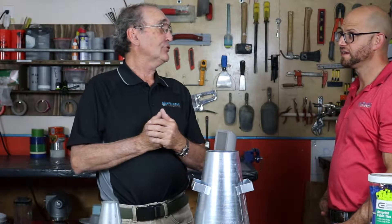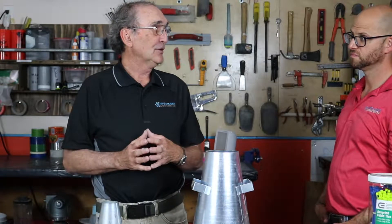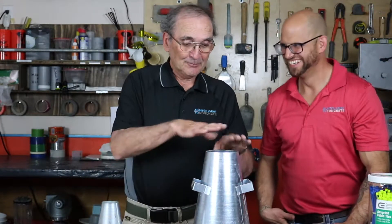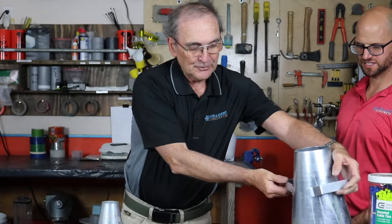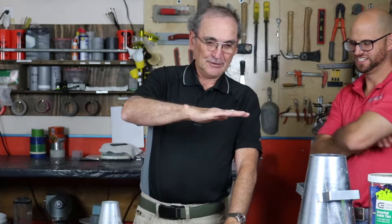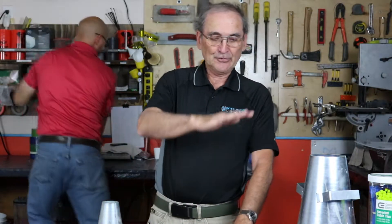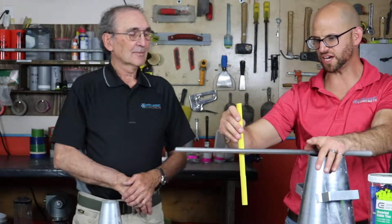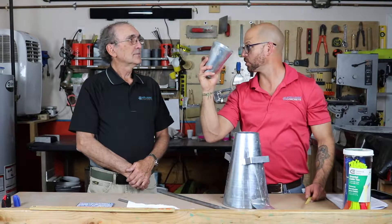We're not going to make any attempt to teach you the procedure — we're not ACI technician certification. We just want to give you the idea of the test, then go on about how it's used, why it's used, and why some people hate it. So you fill it up, pull it off at a known speed — three to seven seconds, no lateral deformation. The distance from what used to be the top to where it currently is, is the slump. That displaced center height is the slump. We have this not only for concrete, but also an in-house version for mortar and grout.